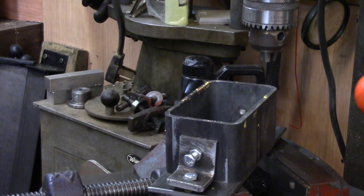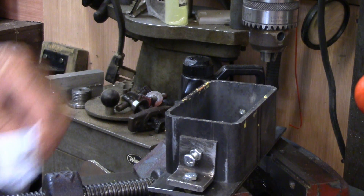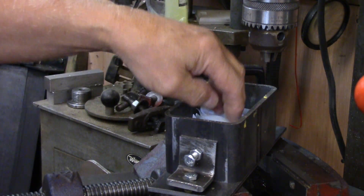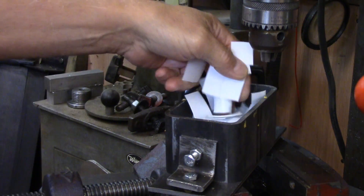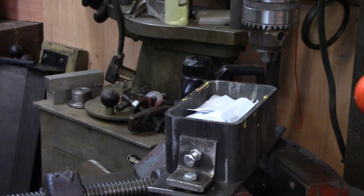Then we're going to squeeze it and we should have something to make some nice HDPE — high-density polyethylene — jaws. I'm going to fill it up. I've got a fair amount of white plastic. White plastic is always nice for things that look real clean, I guess, but it was what was in the top of the pile — that's why I'm using it. I'll fill this little sucker up, put it in the oven, let it cook down. If I run out of white plastic, I'll put in some red or yellow, whatever I've got.